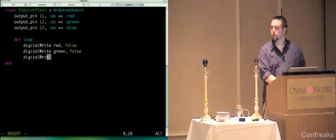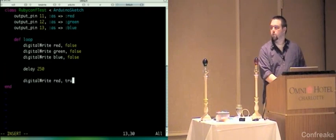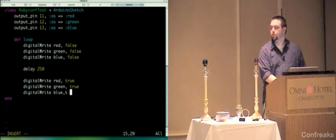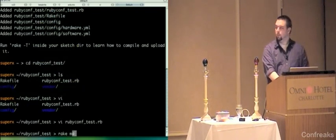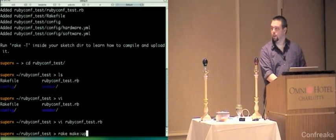Green false, digital write blue false. And then I can delay for, we'll say, 250 milliseconds. Then digital write red true, digital write green true, digital write blue true. Another delay. And we can write this out. And we can just do rake make upload.